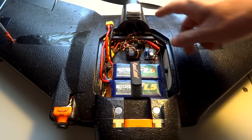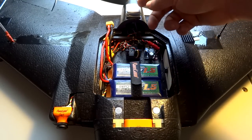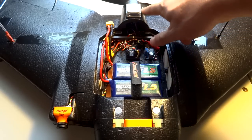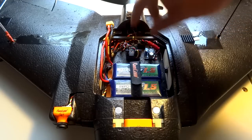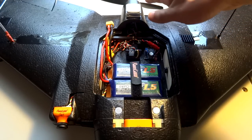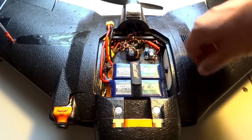I have the BN880 GPS — it's a u-blox chipset GPS using GLONASS, the 8N I believe. There's a little plastic piece I 3D printed that matches the contour of the fuselage, since it's rounded and wider at the front than the back. I drew a little piece in CAD and printed it to give me a flat perch to stick the GPS down on. It's very basic, but if you want it, it's on Thingiverse — I'll put a link below the video.